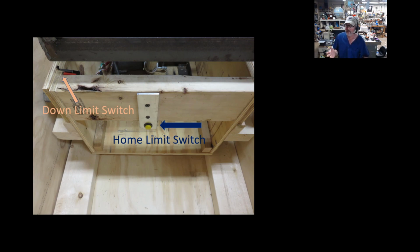And the software is not elegant because with the remote, you just can't push it any time, because it's actually not an interrupt. When the linear actuator motor, the length one, is moving, when you hear that, then it's active. You can push the button on that and hold the button. You'll see that in the software. If you just try to push it, it may not be looking at that pin at the right time. Like I said, it's pretty crude software, but if you know how to run it, it's been working fantastic.